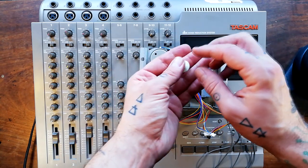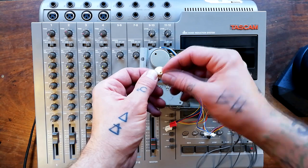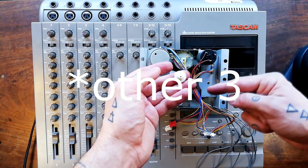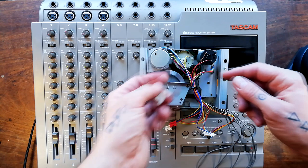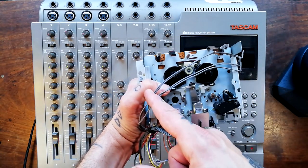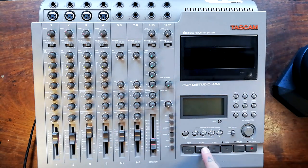I'm guessing that's what it is. This is a replacement part, but often this will just crumble completely — you open it up and it's actually snapped into several bits. Even in ones where you've opened them up and it's intact, it's quite often more of a pinkish-orange colour than the other two cogs in the chain. It's basically poorer plastic — it ages less well. And when that breaks, the buzzing sound you're hearing is just this little control motor turning at full tilt. Depending on which mode the cassette player was in when that gear broke, it's possible for the tape heads to be up and stuck inside the cassette.